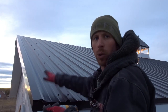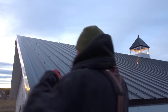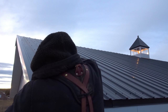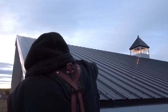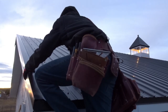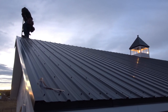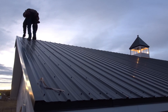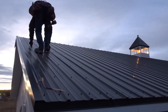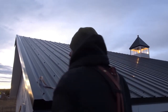I'm going to put all my screws — even though I know I got roof decking everywhere, a lot of times at pole barns when you have purlins you go where the screws are. So I'm just going to make them follow this pattern so it looks nice. All right, got my measurement, gotta go get the other side.